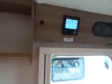You may have seen a warning triangle come up earlier. If you ever get a fault, a little black warning triangle comes up. What I think that was is the gas hadn't lit because I'd only just switched everything on this morning. If you just scroll onto it and click it, nine out of ten times it'll clear. As long as you're confident you can switch your hot water on and get some heating, you're not going to freeze to death.